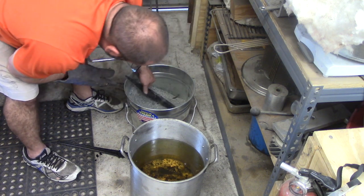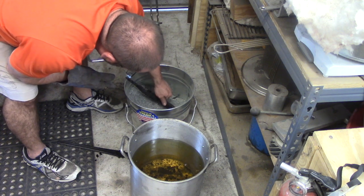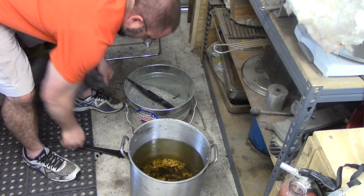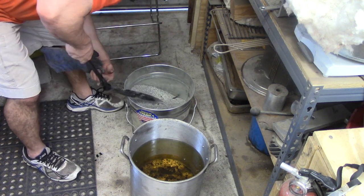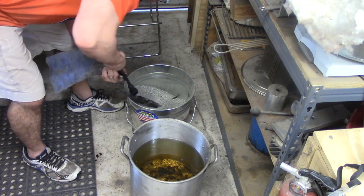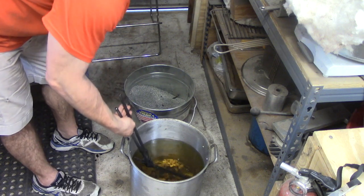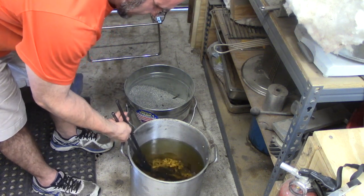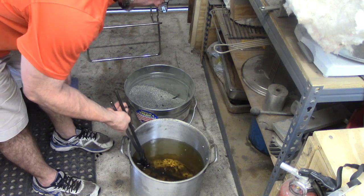And if it's too hot, you might want to go back into your oil until it cools down, because you don't want that heat running into your edge, which it is a little bit. So I'm going to go back into my oil for just a minute and get that tang cooled down just a little bit, because I don't want that residual heat to run into my edge and ruin everything that I just did.